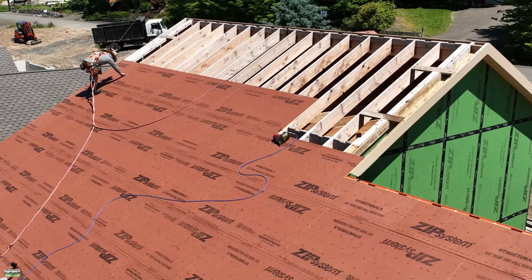I'll show the valley detail in just a minute. When taping the roof, we tape from the bottom up. The four-foot vertical seams — we tape those, then cover with the horizontal seams, and then the same going up. Ultimately it doesn't really matter, except that we do want the warranty. All of these horizontal seams are what we call self-terminating flashing, so water doesn't run down the roof and get behind the tape at the seam — as long as we roll it. We go ahead and set all the tape, then come through and roll all of it.